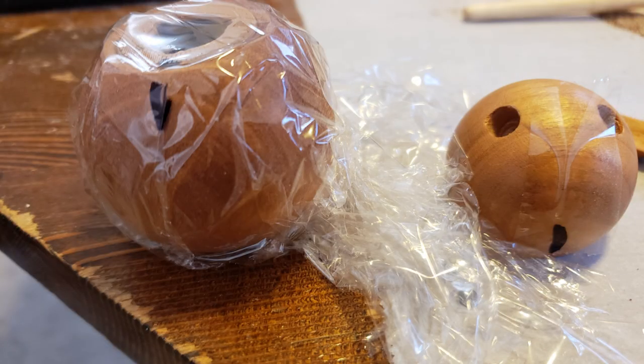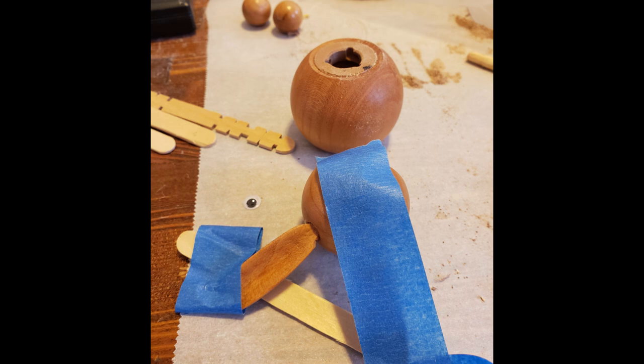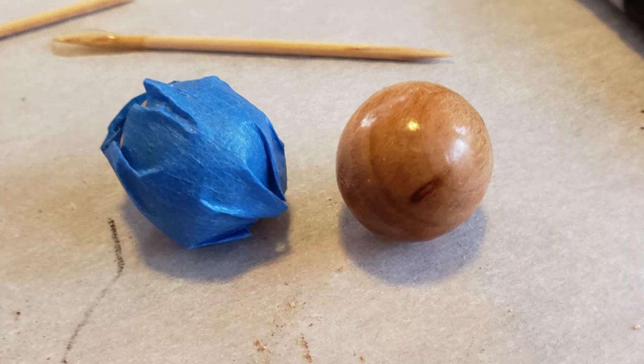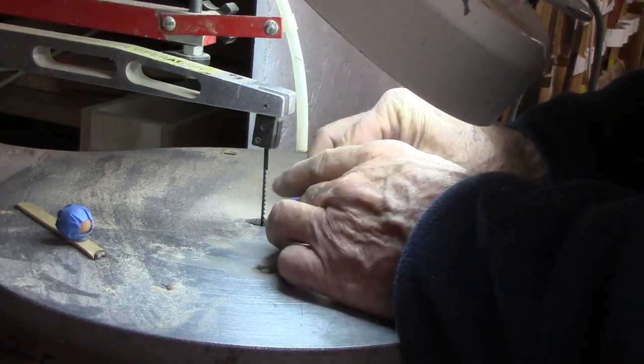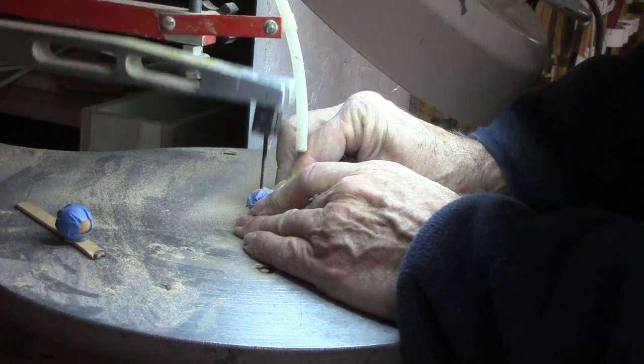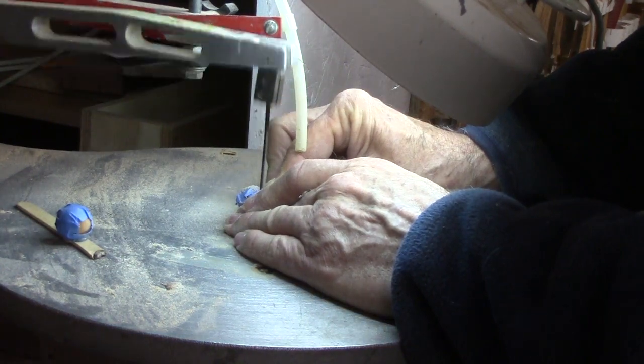Now to assemble the bayonet joint. I used epoxy to glue the female half into the lower body. The bottom is covered with plastic wrap in case of excess glue and the alignment is marked on tape on both the body and the head. Then I glue on the other side of the joint. With epoxy, I glued one ear in and let it set — I could not handle positioning both ears at once. Then using a popsicle stick and masking tape, I made a splint to keep the second ear in position for gluing. The spheres for the feet and tail need to be cut in half. With a small size, I worried for my and the wood's safety during the cut. I wrapped each sphere with masking tape in the direction of the anticipated cut and used hot melt glue to fasten each to a popsicle stick. Since the hole in the table is still larger than a popsicle stick, a popsicle stick could still fall in, so they are glued at an angle a little way from the end so the stick will still bridge the gap. Then the cut was easy and safe on a scroll saw.